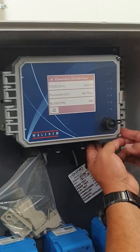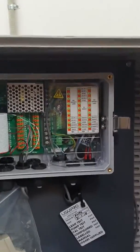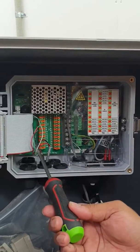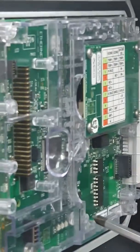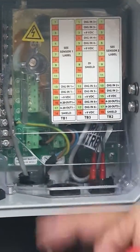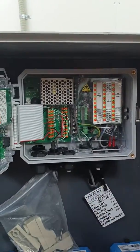I'm going to open this up to show you the inside. The controller is beautifully set up — all the 230 volts are on one side and all the low voltage is on the other side. There's one ribbon connecting from the power to the circuitry, so less things to get in the way and fewer issues. There's also a piece of plastic to make sure that if fingers go in, you don't get electric shocks should the controller still be on while you're working with sensor wiring or a digital input.